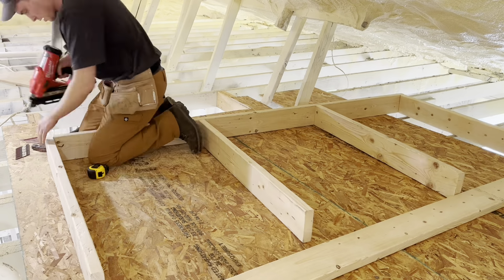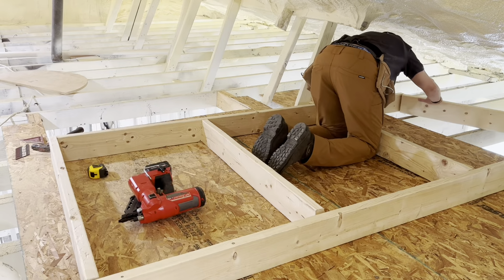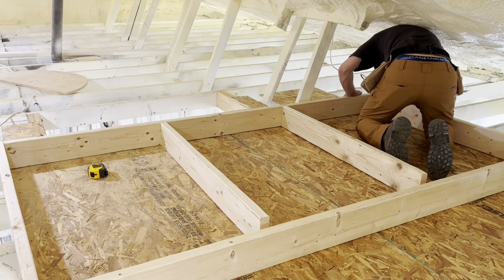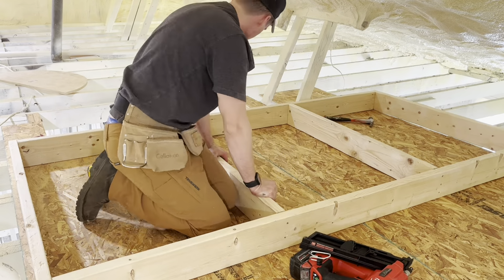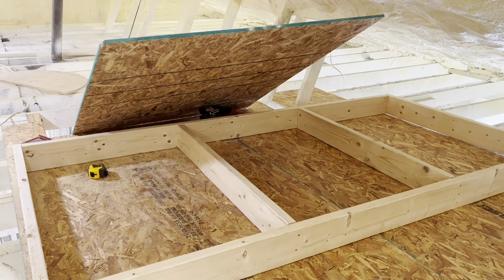Swapping the ends of the wood is a quick fix. If you can remove the nails on the boards, great, but if you can't, don't sweat it. Take a hammer and drive the nails flush into the board. That way you can position the wood how you want without there being any issues.